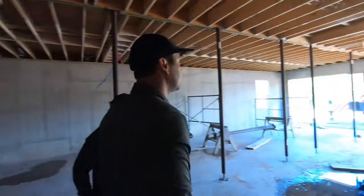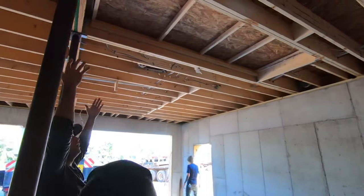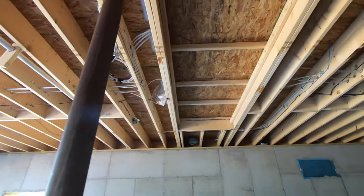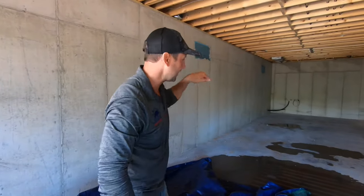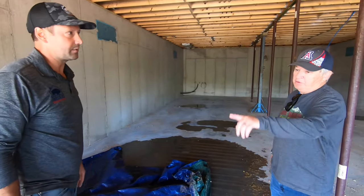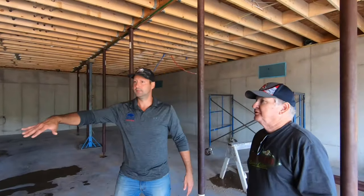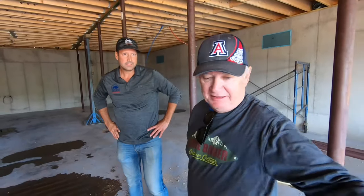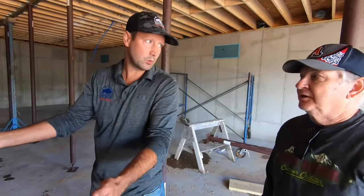There are your stairs over here coming back this way. This is what we were talking about before — the stairwell wall. If you're going to come down straight stairs because it's so high, you're going to end up hitting the wall. So you've got to come down, there'll be a platform probably around here, and you can put stairs down this way or that way, whichever you prefer. You probably go that way because the door is there, and we'll put a landing somewhere. You look at the stairs and look back and there's not enough room. There's not much I can do in the floor plan if I move the stairs — I'd lose the office or whatever.